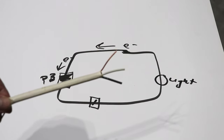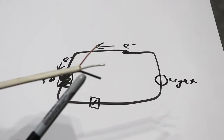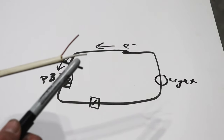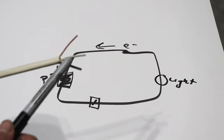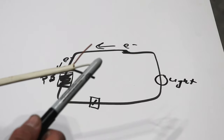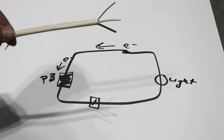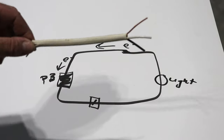In the next section I'm going to show some of the other types of ceiling fans, just in case you have an older one or bought one without a controller. I'll show you how to wire it up with one switch or with two switches, where one switch controls the light and one switch controls the fan. This Romex wire is a 14-gauge wire, and it's called a two-wire because there are two conductors. The ground is a safety to take any current that makes it outside of the circuit back to ground so it doesn't shock anybody.